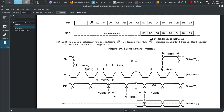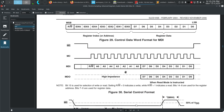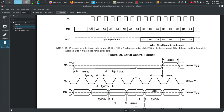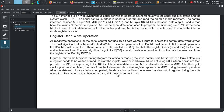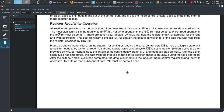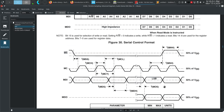So now we've covered how to use a datasheet to determine the clock polarity, clock phase, and bit order without any explicit declarations in the datasheet. I went back and read through this datasheet and there is no explicit declaration of clock polarity, clock phase, or bit order — which is why you need to know how to read these timing diagrams.